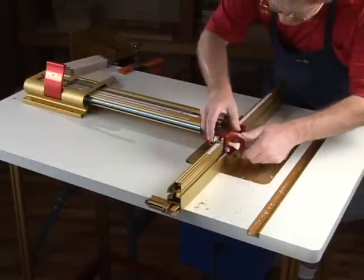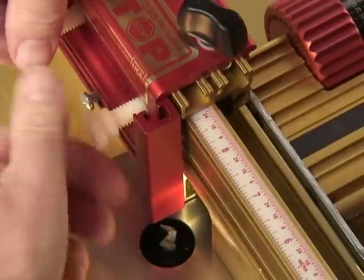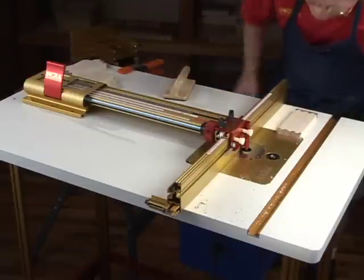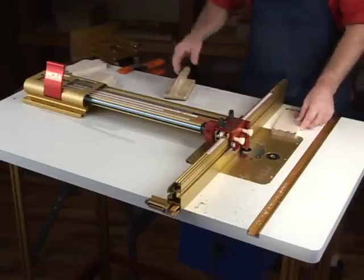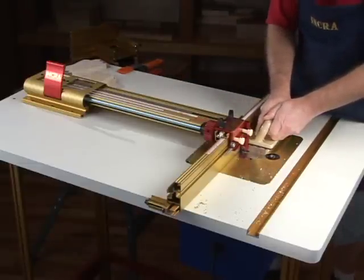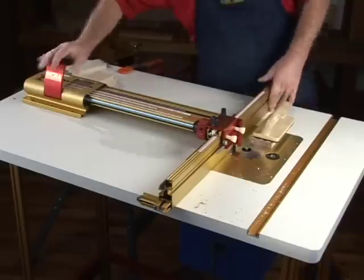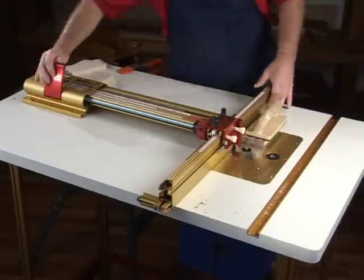Since the pin sockets are stopped cuts, bring the shop stop just up to the outside diameter of the cutter and clamp in place. This stop setup will always produce a socket that is a little short, so we'll only cut one end of one piece at this time, then adjust as necessary. Move the stock into the cut until you just touch the stop. Don't force the material against the stop. Now move from B cut to B cut until you've cut across the full width of your material.